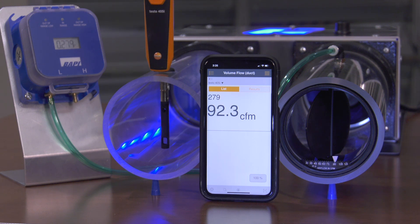Also note the pressure. Next, I will increase the fan speed. Note that the system pressure increases while the ABD again automatically adjusts to maintain the constant airflow of around 90 CFM.